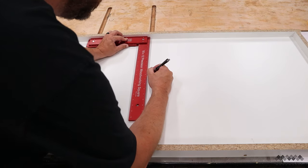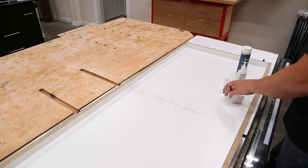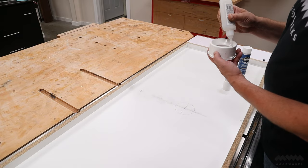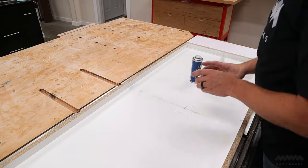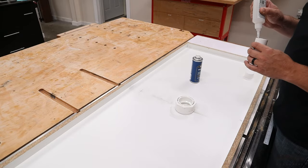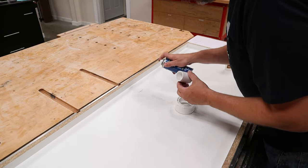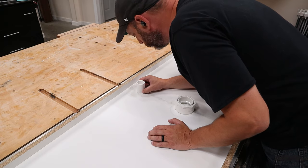I mark a line in the center of the mold and add two circles to mark the spots. I'm using PVC pipe fittings to create these holes in the mold because PVC won't stick to concrete, which should make them easy to remove once the concrete is cured. To get these to stay in place, I attach them with a little bit of super glue — just enough to keep them in place for now.